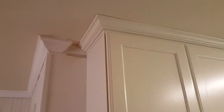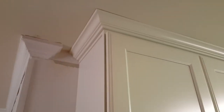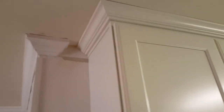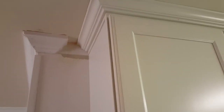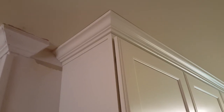Here you've got a transition in crown molding. You have this door stock crown molding on the left that's about three inches on the face, and you have the molding that is from the manufacturer on the right. What we did is we stopped, pulled that molding off, and returned it short to where it has a small gap before the return of the molding from the company — Shenandoah, I think it is in this case.